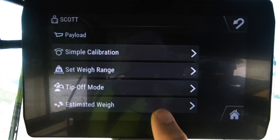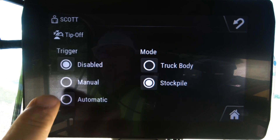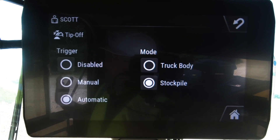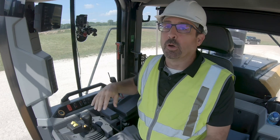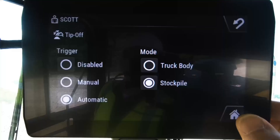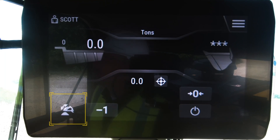In the menu structure, if you do want to use the tip-off mode, you've got to go in and turn it on. Now that it's on, it'll always be on until you turn it off. This is the default mode so that every time you press store, it'll return back to this tip-off mode that you've got selected.